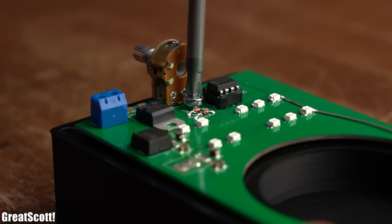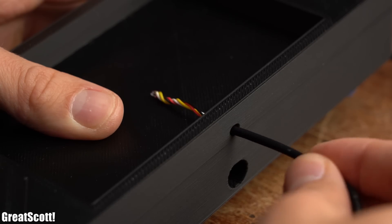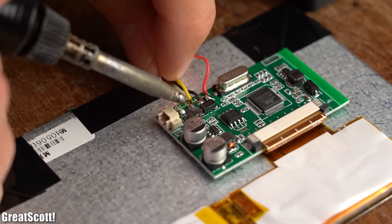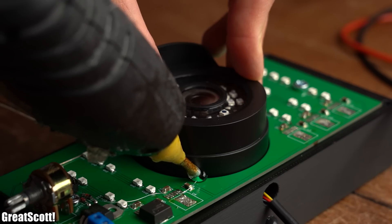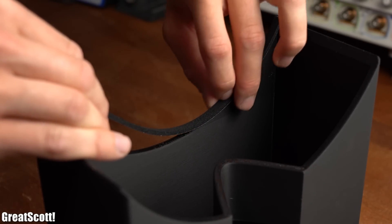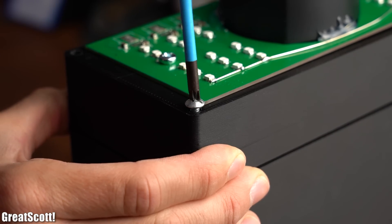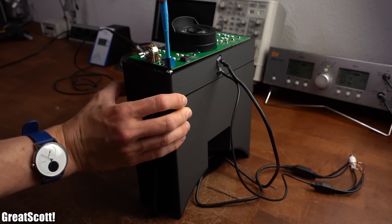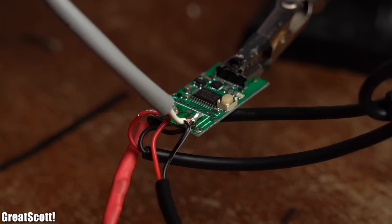Next I mounted the PCB onto the front piece of the night vision device with screws, guided the wires for the screen and camera into the device, reconnected those to the screen and camera, and secured everything in place with hot glue. I cushioned the edges of the 3D print with foam tape and added an elastic strap, then joined both 3D prints with screws. After connecting all ground and 12V wires to the USB Type-C PD PCB, it was finally time to test the night vision device — which, as you can see, works great.